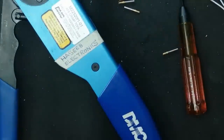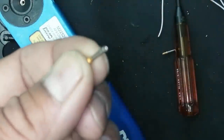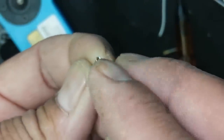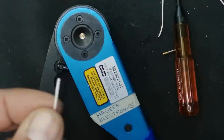The pin is locked. Now this pin is male. Now I will use the female pin. This side is the contacting side. Here is contact, and this side is the crimping side. So I will install the crimping side upward. The crimping side is upward, and now I will make another wire,